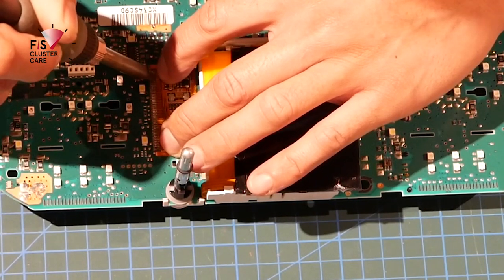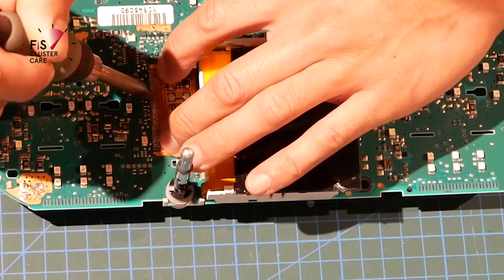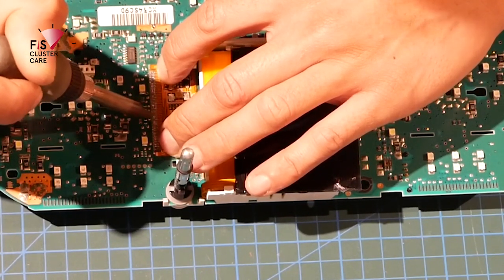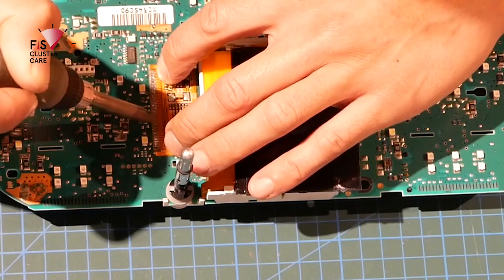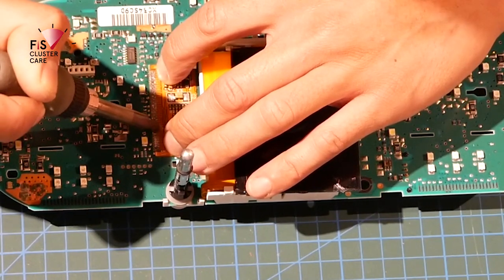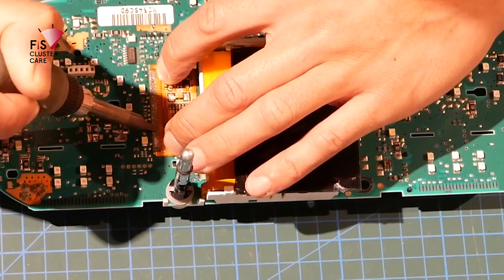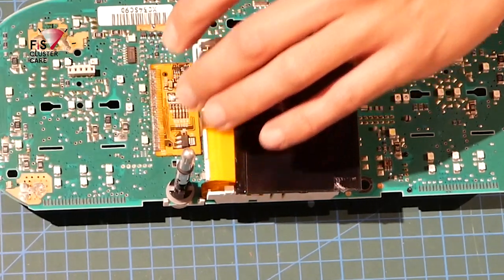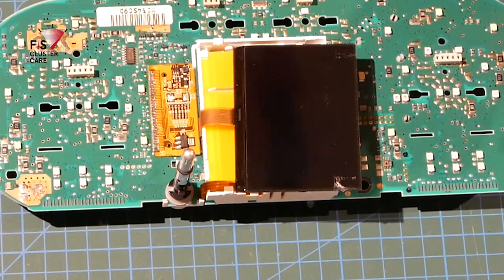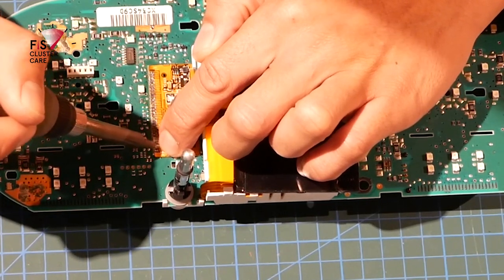All right, so I can see that heaps better now. So, hot tip, don't use side lighting when you're doing a task like this. I can see a lot better in the shadow, but the lighting that I've got was very reflective. And so what I was seeing under the bright light was not what I wanted, and ended up in me misaligning the tracks, but now we've got it right. So if I didn't have it right, there would have been a risk of powering on the board and causing a short, which you never want to do.